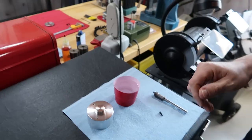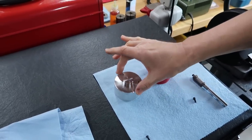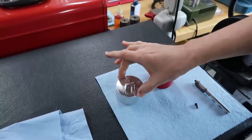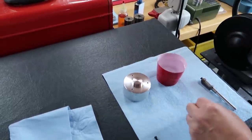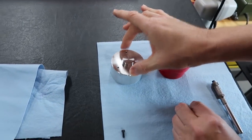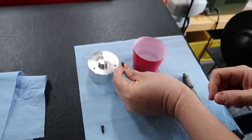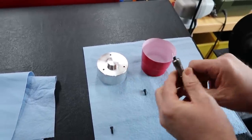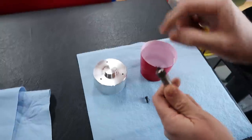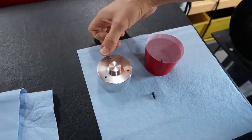Yeah. That's why we haven't run into this before, because this is the first time we're mounting the bearing cap on a fixture for cosmetic purposes. We thought we'd share this because when I mounted the bearing cap cover, I realized when we placed the fasteners in, the fastener is too high. It's actually the same height as the bearing cap cover.